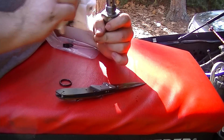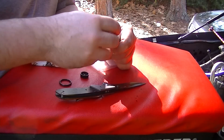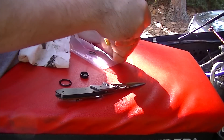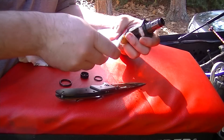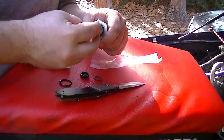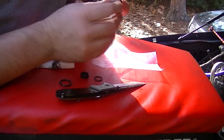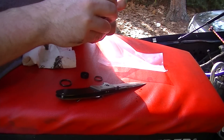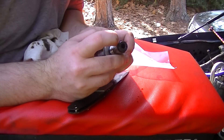We're gonna make sure everything's nice and clean there. Take our big o-ring — that'll go in first. Get it down on there. Next is our square o-ring. Get that on there, and you want to make sure that this isn't twisted up on here either. Just working my way around it. There we go.